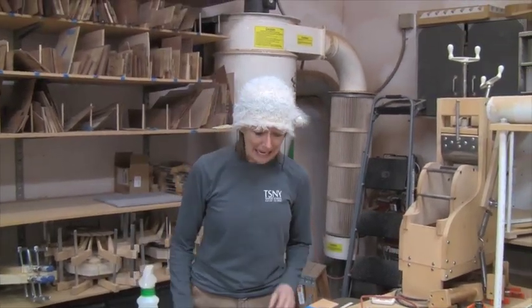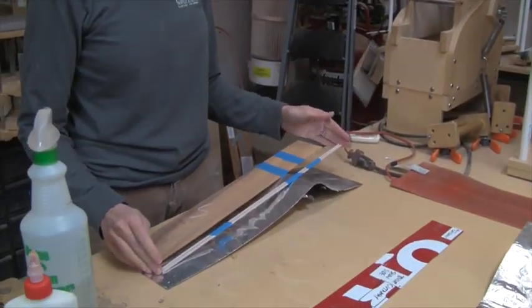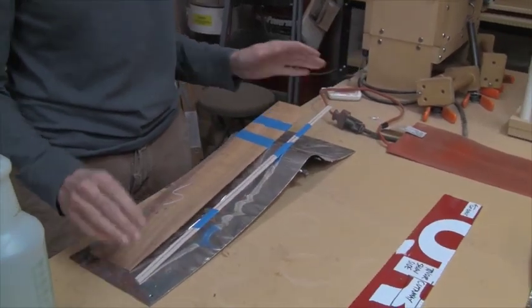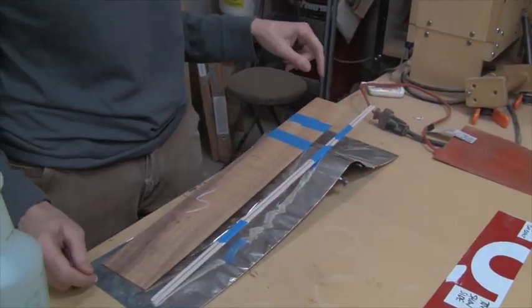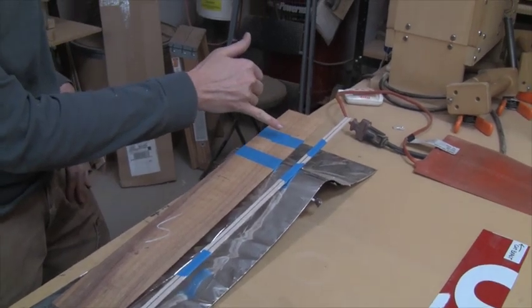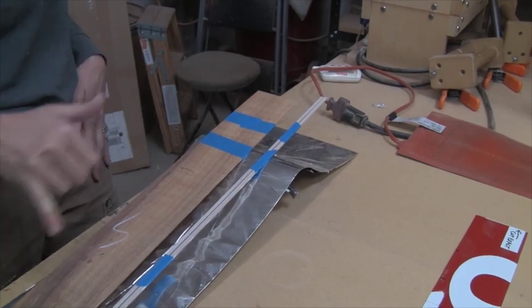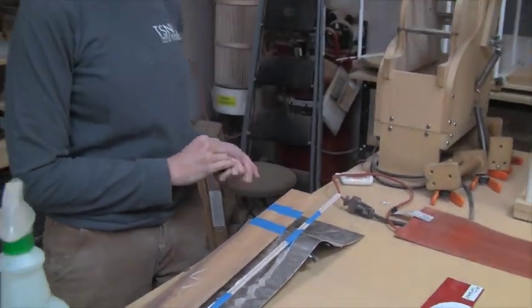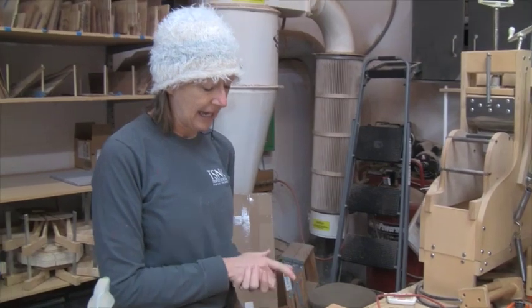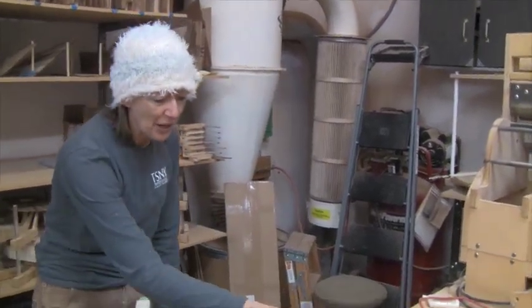I'm back. I have taken a little bit off of this side that we're going to bend for the cutaway. I've matched up and gotten some binding pieces — this koa is going to get some maple binding. I've bent these together so the curves are the same. I've also applied some masking tape on the binding pieces and the side in the tightest part of the curves so that I can alleviate some of the proneness this has to grain lifting.